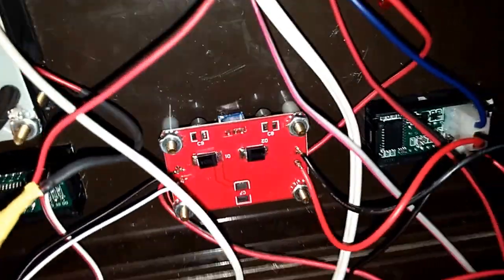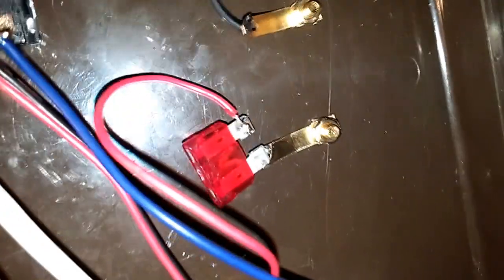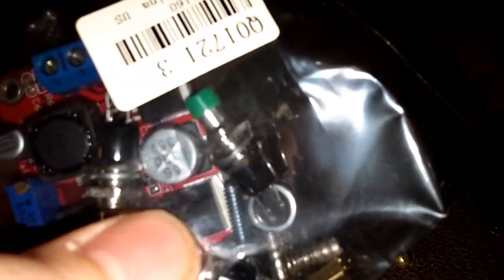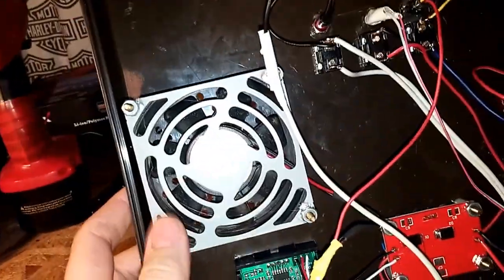There's the voltage regulator. I have holes here so air comes up through the chips because they get pretty hot after a while. There's my ghetto-rigged 10-amp fuse — I need to put a 5-amp in there, but just in case those two get shorted it won't blow up my regulator. I blew one of these up on accident because I didn't have a fuse when I was testing everything — it blew up. That chip right there has like half a corner missing.